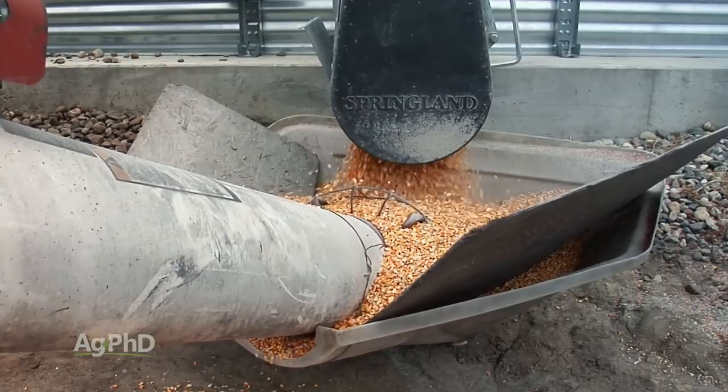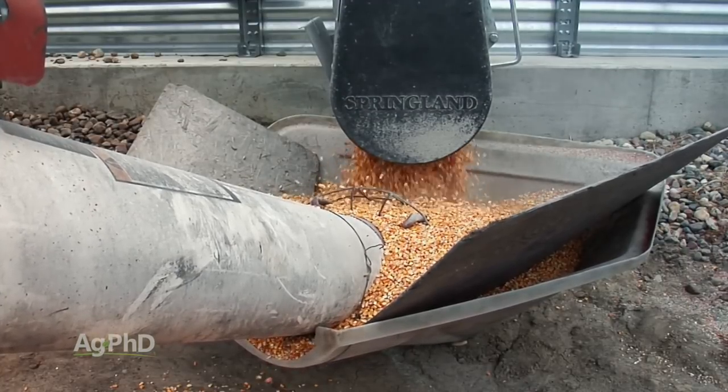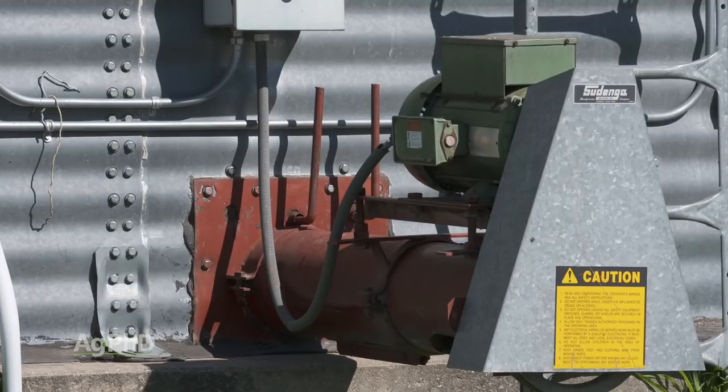And it's like a lot of things. Oh, wait, stop. What do you mean by a real issue? That can be a real issue. How? Well, if you've got an auger that's bringing the grain out of the bin, and a farmer goes in there with that auger running, he's taking a lot of risk. So we just want to be real cautious about that. We want to shut that auger off, go in, do what repairs you need to do, and then get back out of the bin before you start back up.